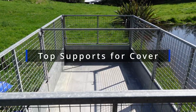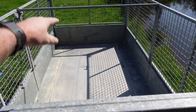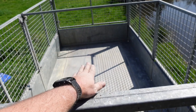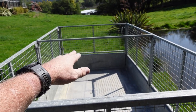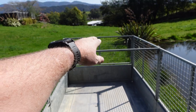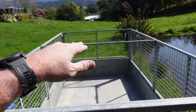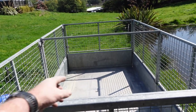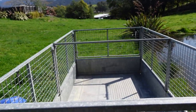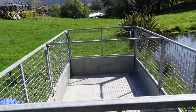Just before I fit the tarp — one thing I'm looking into is something that will hook onto the front bars and the middle bar to cover that area. When it rains, the tarp sags because there's nowhere for the water to go. If you had some sort of grill fitting across there and on the back one, it would prevent it from sagging so much. Every time it sags with the weight of water, it puts stress on the bungees and all the hard plastic corners. It would be advisable to tip it slightly just to get the water off the top, then bring it back down.